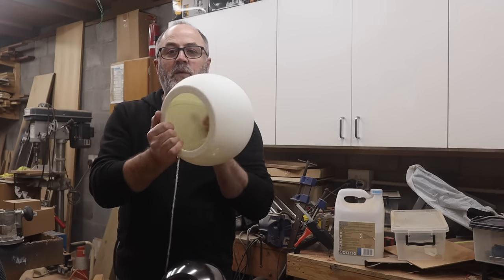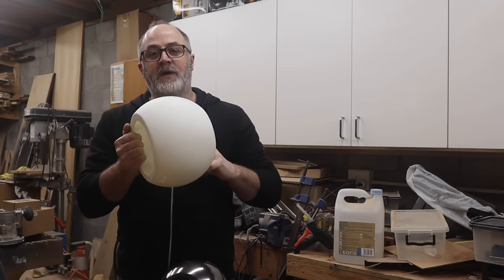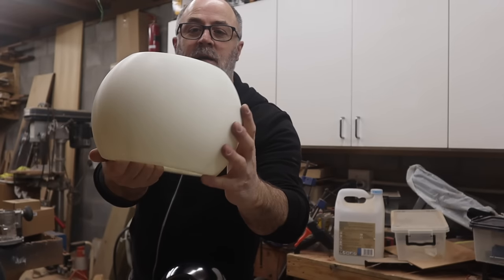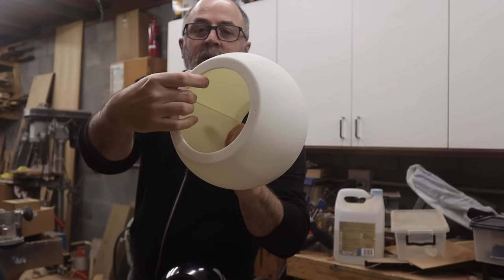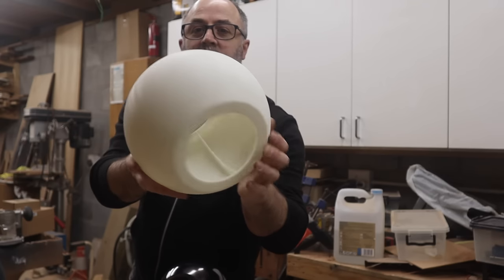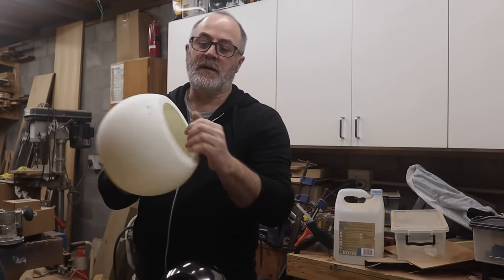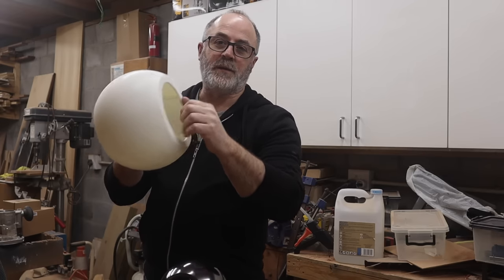Now I designed this little small enclosure. This is 3D printed in an SLA process from resin by JLC PCB. And I must say the quality is absolutely excellent. This is a one piece print, which is quite amazing. I've designed it so that it's got supporting fins or supports on the inside as well. I think it's about a 3 millimeter outside wall thickness, and the flanges where I'm going to be mounting the loudspeakers are about, I think, 5 or 6 millimeters.